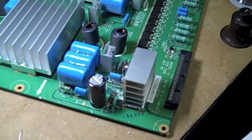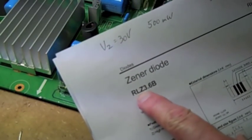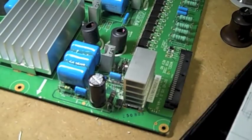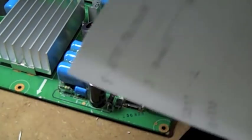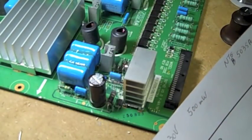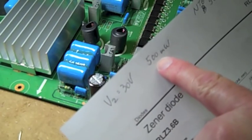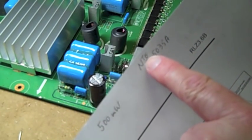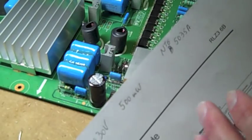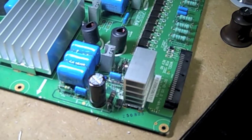I had a hard time tracking down what they were, but it's actually an RLZ33B diode type. I was able to cross-reference to an NTE part number — it's basically a 30-volt zener at half a watt or 500 milliwatts. The NTE part number is NTE5035A. Now that's not a surface mount part.